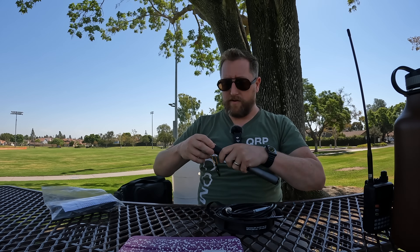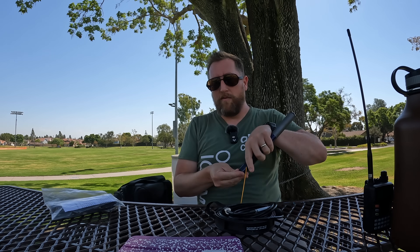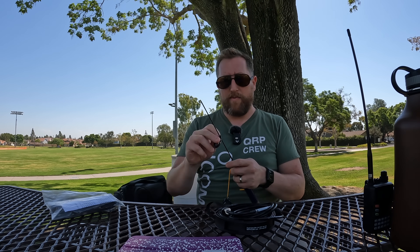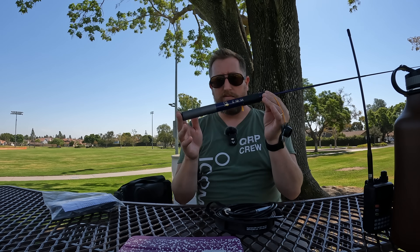So much like the last time, it's pretty straightforward how we do this. I literally just connect the antenna up, get it in the air, connect it to a radio, squawk out on two meters and 70 centimeters, and we look at the numbers. I also have a transmit radio at home set up for remote control, completely under my own control, and I use that to send in a test signal along with my call sign. This is my little cheap fishing pole — it only goes up about 12 feet or so. I use it for VHF/UHF roll-up antennas, and I'll post the link in the description.